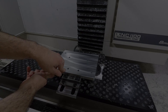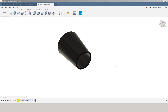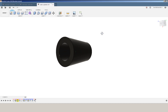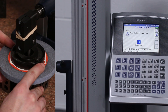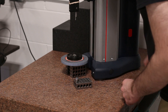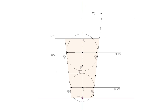In order to mount a proper surface grinding wheel and arbor to the straight shaft of this bench grinder, I had to 3D print a small tapered adapter piece. And since the angle of that arbor's taper doesn't seem to be published anywhere, we found this great trick that we have to share with you guys that will allow you to measure the taper of any angled bore. All you need are two ball bearings of a known size — one which fits near the small end of the taper and another which fits near the large end. Measure the height of the highest point of each of these balls from the same datum surface, and then plug those measurements into a simple CAD sketch to very quickly and precisely calculate the angle of that bore.